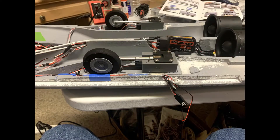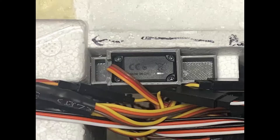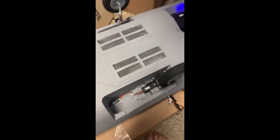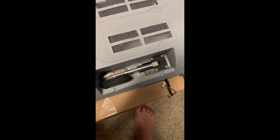The main retracts came from the F-35 and the nose retract from the T-33. I needed to build some mounts — those gray pieces — and those mounts along with other components I made are available on Thingiverse, linked in the description. I did have to do a little sanding to make them fit. For the nose I had to put in a servo to handle the nose wheel steering.